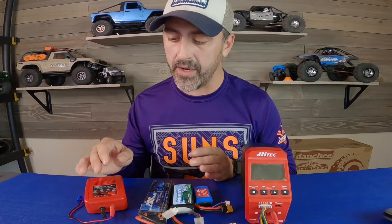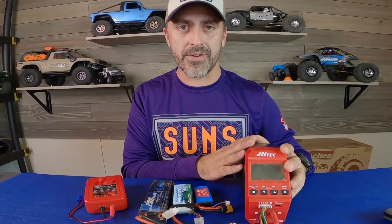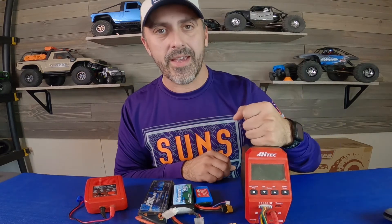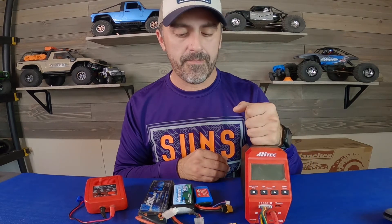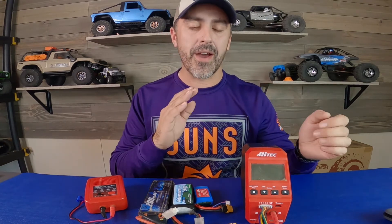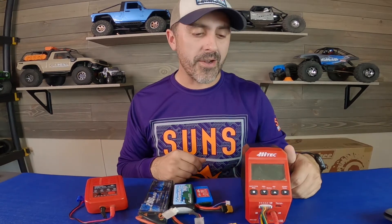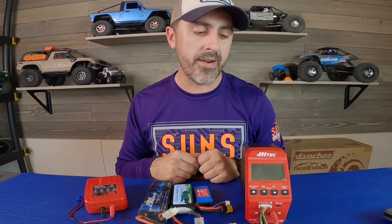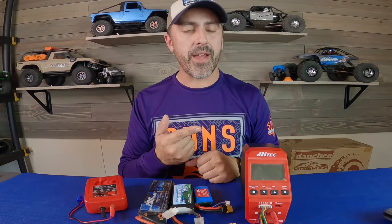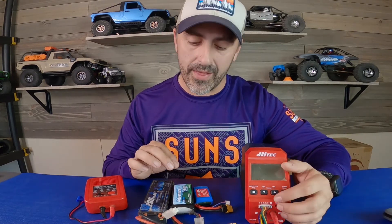You can get a voltage meter — there are a lot of things you can do — but this is such a simple way, and there are a lot of chargers that offer this feature. It's almost foolproof: you plug it in, select the correct mode, press start, and when it's done you've got a battery that's balanced and safe to store, keeping the hobby fun and safe. The Hi-Tec RDX at around $170 is what you're after if you want the safest experience with LiPo batteries. Thanks for tuning in — make sure to click that subscribe button before you leave and we'll see you in the next video.